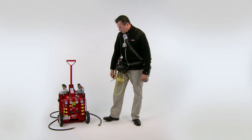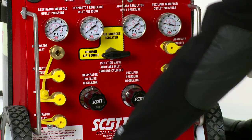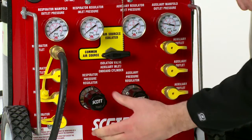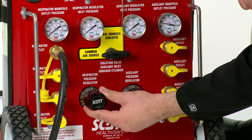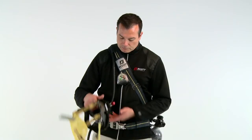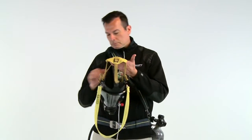Position the required length of air supply hose and prepare it for use by connecting the segments to each other and to the air supply system. Adjust the pressure at the air supply system to the operating pressure of the respirator. Repeat this step for each air supply hose and each air supply system to be used. Adjust all head straps to the full outward position. On respirators equipped with a neck strap, place the neck strap around the neck.